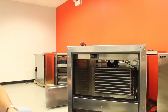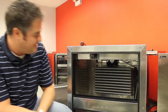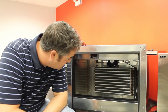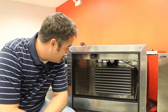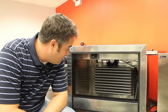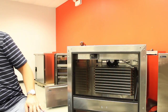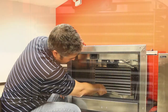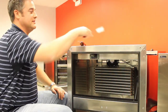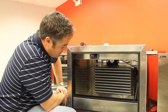And there's your evaporator coil. If there was any ice on the coil, you might want to wait for it to defrost — you could use a heat gun to speed that process up and melt all the ice off. If there's any dirt on the coil, get in there with a brush and brush the coil off. If you can see through all the fins after the dirt is removed, your coil is clean. If all the ice is off, your coil is defrosted.